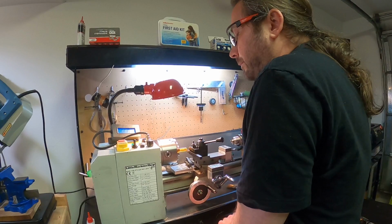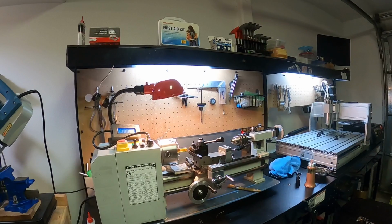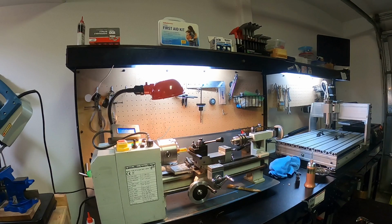so it's gonna be like, this is where I'm gonna grab my calculator out and do the math, because I've got to divide by 2 as well. So, oops, 15.2 minus 4.7, 10.5 divided by 2 equals 5.25. So that's the maximum that you could go in, and then you would hit the hole.